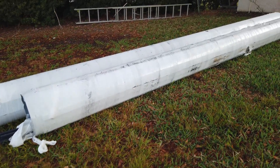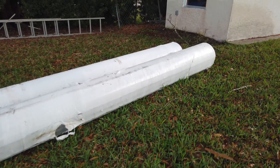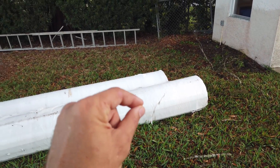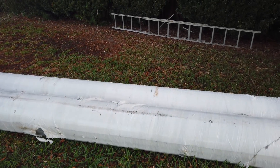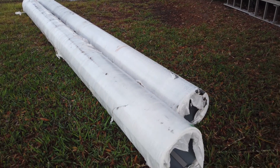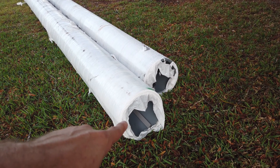They're these big plastic tubes that kind of snap around the pilings. They open here and snap around. They're available in some different colors. Once you snap them around the damaged pilings, you fill the inside with concrete and then they're good to go for about 100 years. That's the basic gist of it. Let's get right into the construction process.